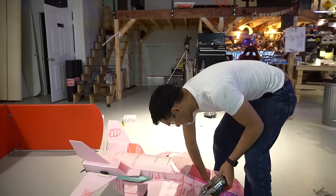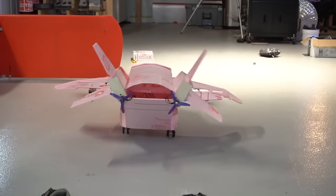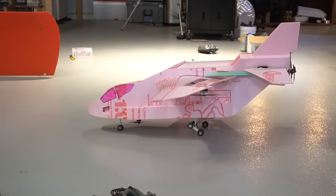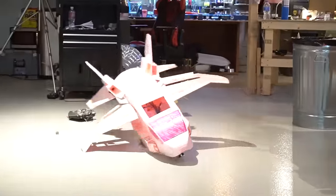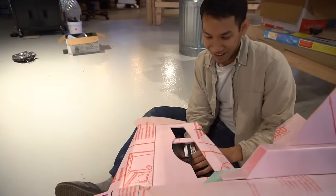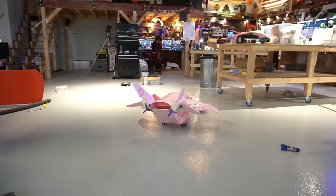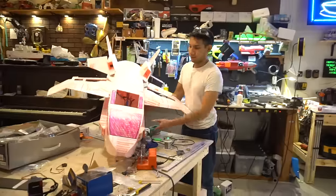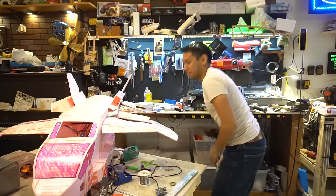I don't think these motors have enough power to lift this thing off the ground. I don't have the right propeller, at least until Monday, so I just doubled up — these are designed to turn bigger propellers, so whatever. There's not a lot of thread there. Unfortunately, I don't have a whole lot of time to keep messing around with this. We're getting close, but this thing really needs a lot more thrust, and if you need more thrust, you need bigger propellers, and then it starts looking stupid.